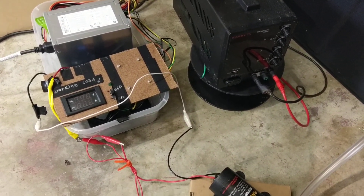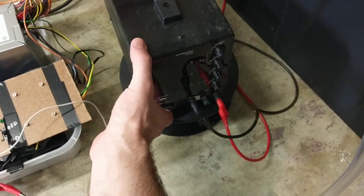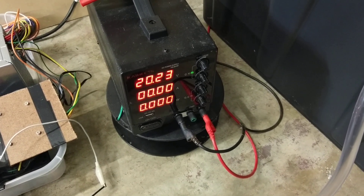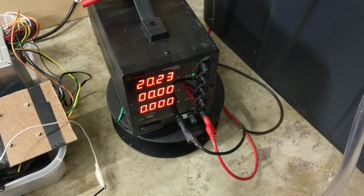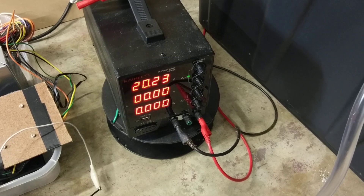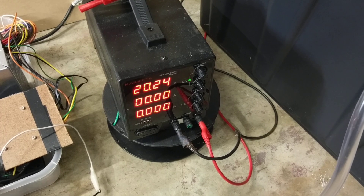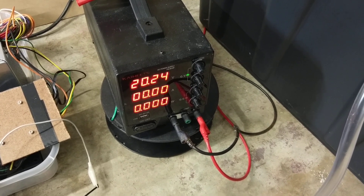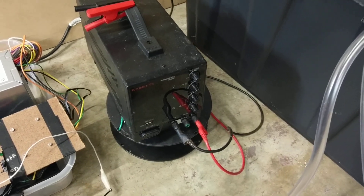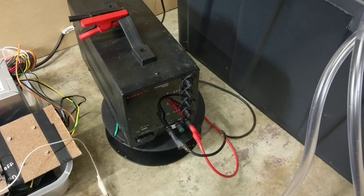You can run yours off of a wall charger or whatever. This is a variable DC power supply and this is what you'll actually use for the cutting process. You can also use a battery charger or car batteries if you're really in a pinch — anything that can give you a low DC power supply and push anywhere from 2 to 8 amps. Less amperage just means it's going to work slower, so your cut times will be longer. But as long as you can have a stable amperage, you're good to go.